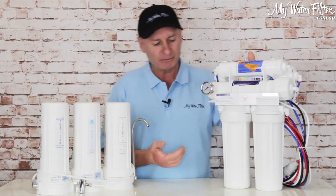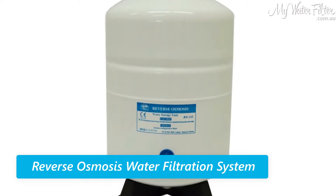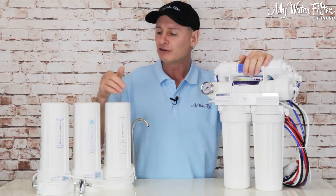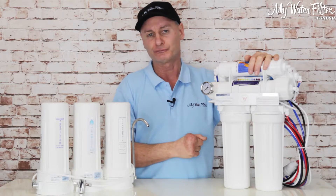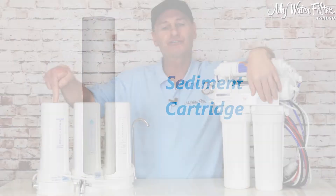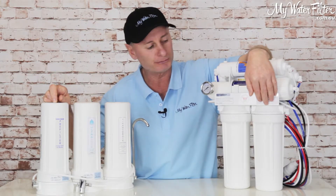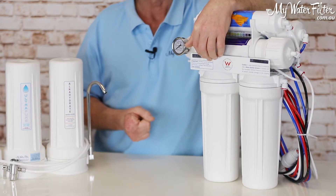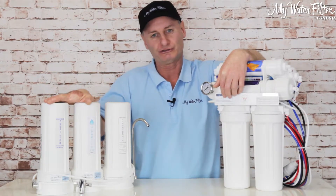For years people in capital cities have liked the old twin setup. But this here is a reverse osmosis water filter with a tank that goes with it — and this is what I use nowadays. I've gone away from mechanical filtration at home in the city and we're using reverse osmosis. The water comes in first into a sediment cartridge — lumps and bumps, dirt, sediment in city water as well — then this part here is the chemical remover: it gets the chlorine, chemical nasties, herbicides, and pesticides out. These first two stages are pretty much doing exactly what the two cartridges on the mechanical system do.